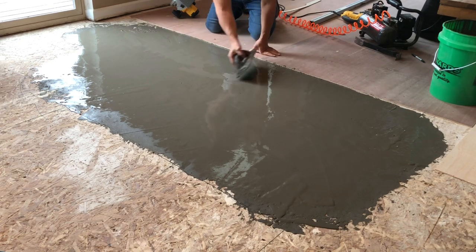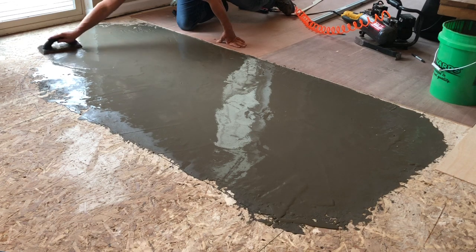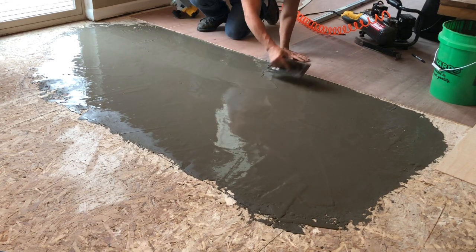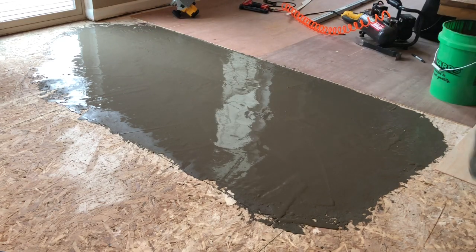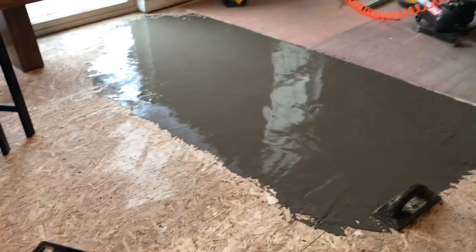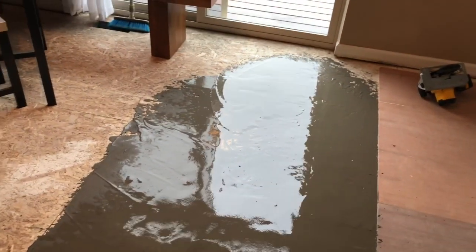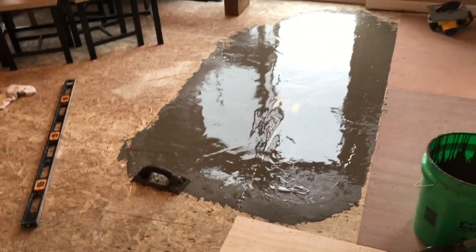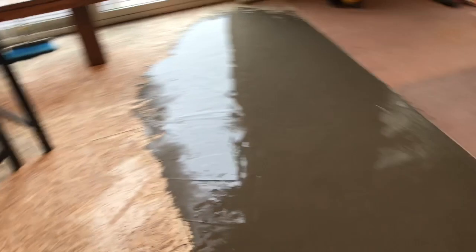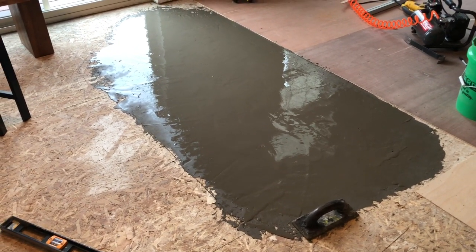You guys pretty much get the idea — you're spreading it and that's about it. Come back after 10, 15, maybe 20 minutes, feel it out, take a little scraper after using your leveling bar, and scrape back and forth to get out any little humps or lumps. That's how I level a floor with an imperfection in it. Leave a comment, tell me how you do it — maybe you've got a better way. Mine's not the wrong way because it works. Have a good day, give me a thumbs up — thanks for watching.